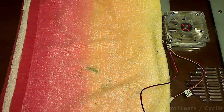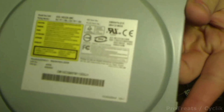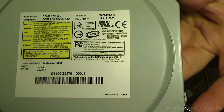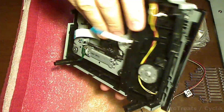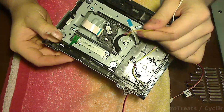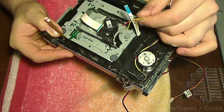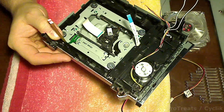Not impossible, but impossible without doing some soldering work. This is the drive that I'm talking about right here. I've taken it apart and I've got it gutted. I took the control board out of the bottom. These little wires here are actually soldered on. I took a picture of their positions on the board and then I heated them up and took them off, so it's separated.